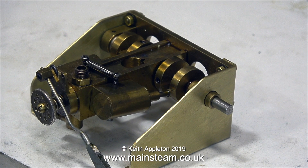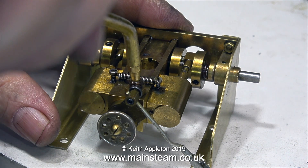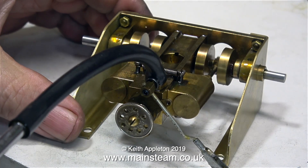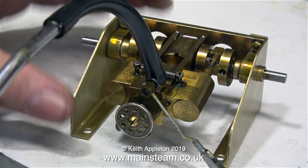What's next? It's time to test the engine and make sure it works. Here it is mounted securely onto its mounting base, and as always before running a steam engine it's very important to oil it — starting with quite a bit of oil into the inlet, which will lubricate the cylinders. I also applied some oil to every other moving part of the engine. For a quick test I'm connecting a piece of silicone rubber tubing to supply some compressed air to the engine, and as you can see it runs immediately.